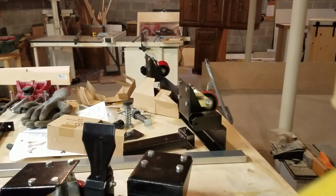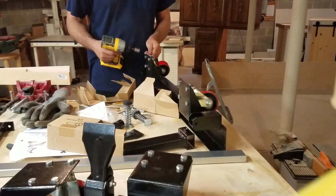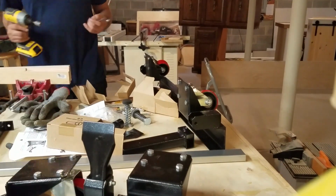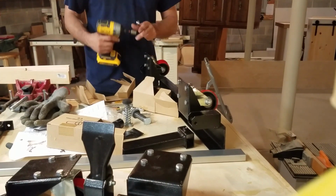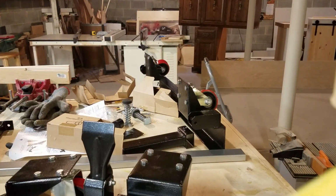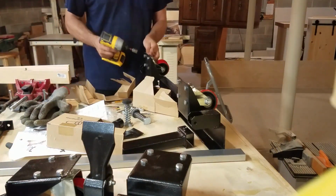Got these casters, they're both swivel on the extension bracket. Have to tighten these up. The same as the casters on the bear crawl base. All right, you know what? I did need to switch sockets, I forgot. So I was using a 14 millimeter on the bolt for the fixed casters. And now I'm going back down to a 13 millimeter just because that's what I grabbed and it fit. And a half inch wrench to tighten these up.